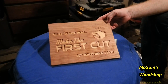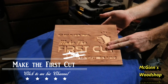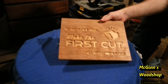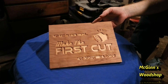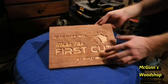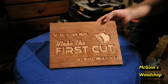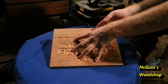So this is one of my first signs. I did make the first cut. I want to try fonts and take a picture and put it in with it as well. I also did one for the bearded builder, but he's taking his sign home, so I'm going to show this one. This is basically a half inch quarter piece of cherry plywood, and I've carved down just deep enough to expose the white plies underneath. The attempt here was to cut the sign out and make a really nice sign. But as you can see with the material, I've learned that plywood with small little things left in the centers chip off and break real easy - that's just because the plies come apart. That has nothing to do with anything but the material itself. So in doing something with this much accuracy, I wouldn't be using this kind of material.